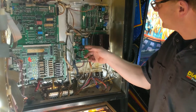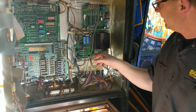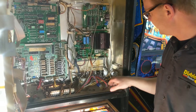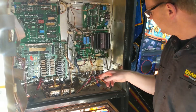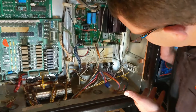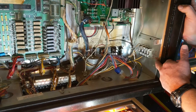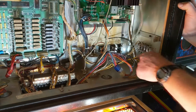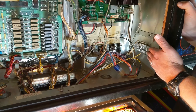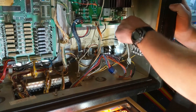Power supply — I had to change out the big cap. I did not touch the high voltage caps, but I changed the other capacitors. On this particular game, for the GI fuses, I mounted them off to the side and separated it out so I'm not even using the circuit board at all. Normally it would go in here and come out there, but I just totally bypassed it and did the four lines individually.